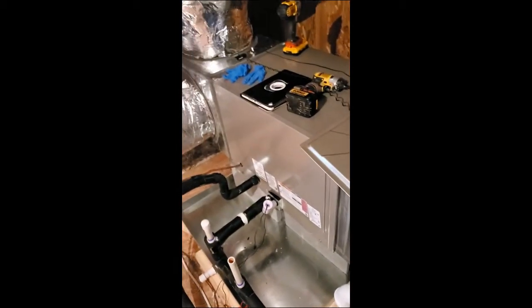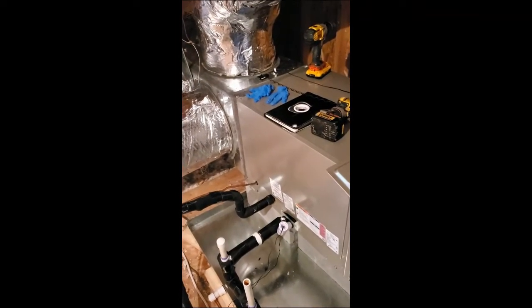You want to make sure that you put these sensors in places where they're going to get good contact with airflow and not in dead areas. Also want to make sure that you're not putting them too close to a heat exchanger, which might make it read the radiant heat of the heat exchanger and throw off its readings.